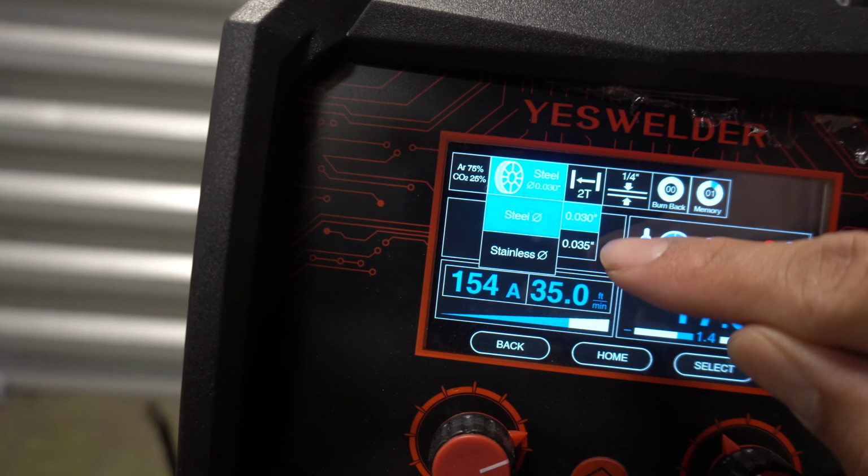Whenever I'm teaching other students how to weld, I always tell them to get familiar with the machine, with your heats, your amperages, because that will help you out a lot. Now, if you're stick welding and you feel like the metal is not spreading out and it's just kind of balling up, it means you're too cold. You have to crank the machine up a little bit hotter. Or if you're welding and the metal seems to just be cherry red and it drops, or you make a big old hole, it means you're way too hot. You have to turn it down. Just make sure you get familiar with it. Turning it up and down on the 3/32 function is really, really accurate.